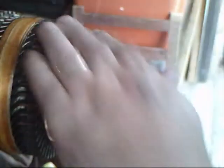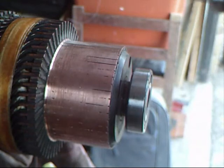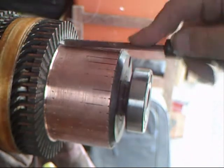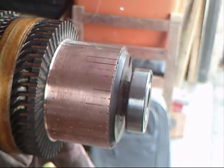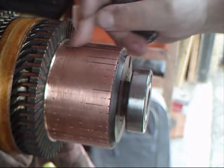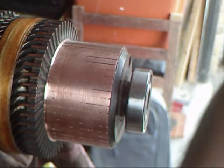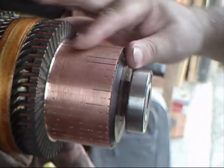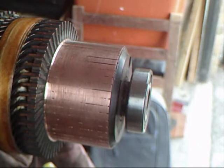Sticking it upside down, put it straight down, just drag it through — make sure there's nothing stuck in there. It should be nice and clear now, and hopefully we get no electrical circuit between the two segments. Just make sure you're wearing goggles when you blow that out, or you get the copper in your eyes — not good. So that's it, that's one channel dug. So I've just got to recut the rest of it.